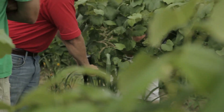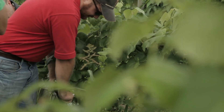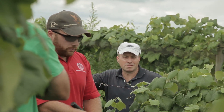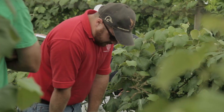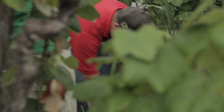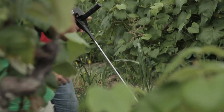I've been in a couple spots where I put all my weight on it, feet off the ground, and it wasn't going any deeper. We push it down and it's 200 right there, then it will break through the layer eventually, but it's over 200 at 10 inches down. Out in the row middle where the tires would be, we're already over 300. Those compaction layers were at about six and then again at 10 inches down.